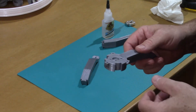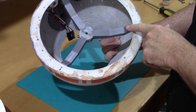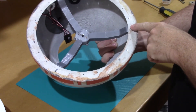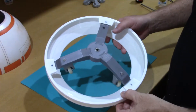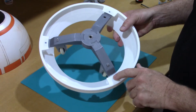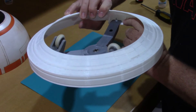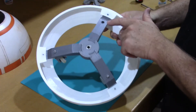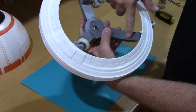Pound the leg into place until it's completely flush on the top side. You want to make sure it's exactly flat — you should literally not be able to feel a seam. Repeat that on the other two legs. That's essentially how you assemble the upper and lower portions of the mount. For the lower portion, orientation doesn't matter; for the upper, make sure the tabs are in the correct position. Let the legs sit for about a half an hour to fully harden, then repeat for the next two legs. For mounting the upper head mount, slip it through the hole and use three 4-40 screws that are countersunk with a simple nut on the back side. The lower caster mount is assembled the same way.